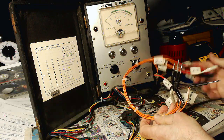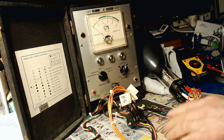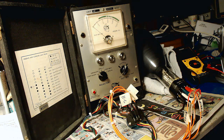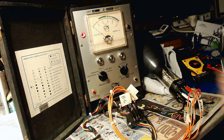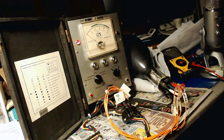See my handiwork here? I used nails and alligator clips. I've got my adapter hooked up to the pins here and they're going to the proper pins on this tube. So what we're going to do first is turn this on. The filament should come on, and G1 and G2 should come on. Let's let this set for about a half hour. Okay, that's been sitting there for half an hour. The G2 light here is dimly lit. So because those lights aren't lighting up, it's not going to produce a bright picture — and we already know that.